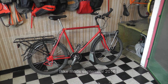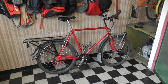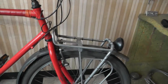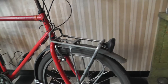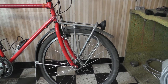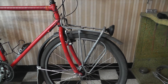The Mule 2.0 — I just got back from a bicycle trip and I'm already thinking of version 3.0. Not that I want to take even more luggage, but the problem is in the front: the baggage carrier moves back and forth with the front wheel. When you have a lot of stuff on there, the steering becomes really heavy and the frame wobbles. So I was thinking about making a baggage carrier that is fixed to the frame and not to the steering.